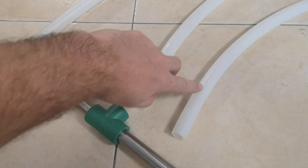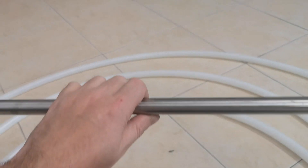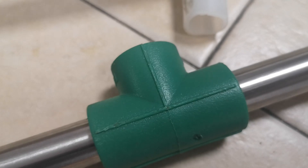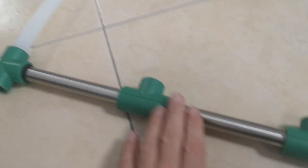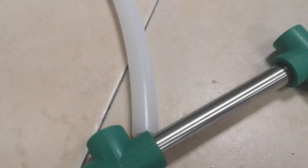I have taken this measurement from the center line of the tubing. We take our metal tubing and cut it to 1,300 millimeters — the diameter of the tubing I have chosen is 18 millimeters. This is actually slightly smaller than the 20mm of the fittings, but there is a reason for that which I'll cover later. When we finish preparing the metal bar, we have a fitting for the large arch, one for the medium arch, and one for the small arch, duplicated on the other side.